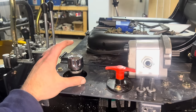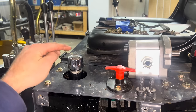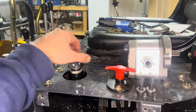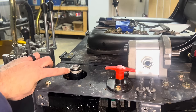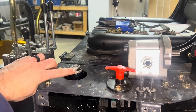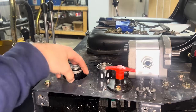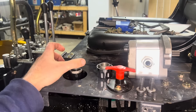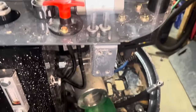Before I get too far into this, I want to talk about actually being able to drain the oil out of this thing. This is the fill cap - no mystery there - but what I want to point out is if you take this cap off, this is just an adapter that threads down into your fill tank. Make sure it's nice and tight; this o-ring is really doing the sealing for you. If you take a standard shop vac hose and put it over the top of this, it fits down inside the recessed portion - you shove the shop vac over there and turn it on.